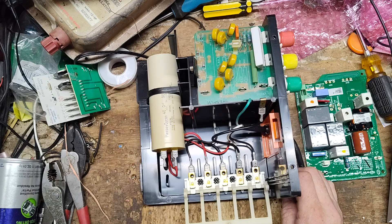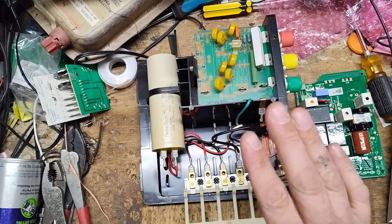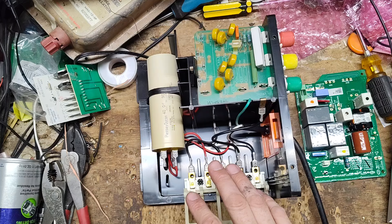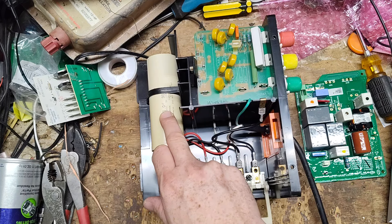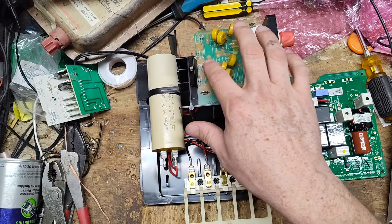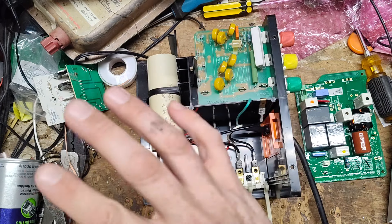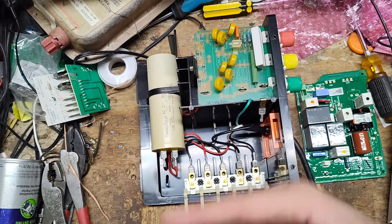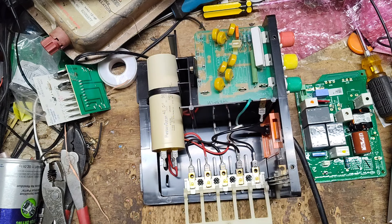This version is about 25 to 30 years old. The board was shot, and Gallagher no longer makes a board for this model. The capacitor is good, and so far we believe the transformer is fine and the output board is good — we need to do a ground fault test on it, but I can't do that until I get the thing to stabilize and run right. So the main board is shot, and I'm going to try two different things.